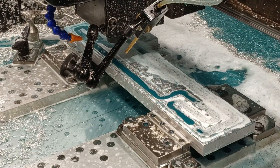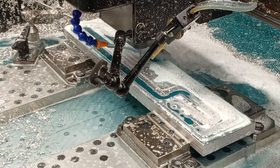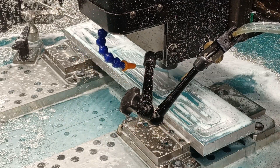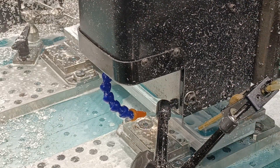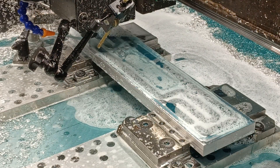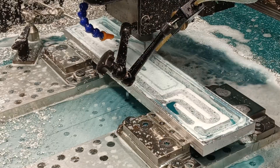This is the full-width slotting. I'm then going to go back on both of these o-ring grooves and go full depth with a single pass to clean up the opposite side of the o-ring groove. This is an eighth-inch end mill but the slot is 140 thousandths wide, so that's 15 thousandths of material still left on the one side wall. I'm doing the outer wall with a ramp and then the inner wall will just be full depth. Now I'm at full depth and just cleaning up the inside wall - it's only 15 thousandths stepover, which is basically the same chipload I had before when I was going 15 thousandths deep with each cut.